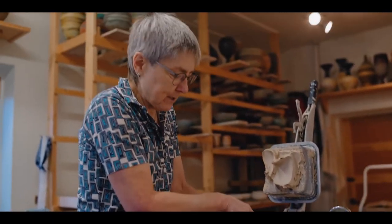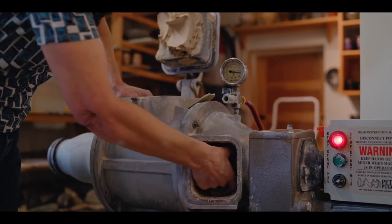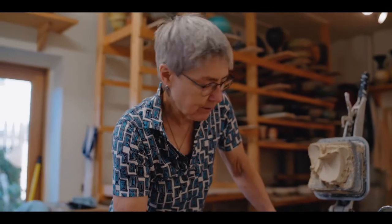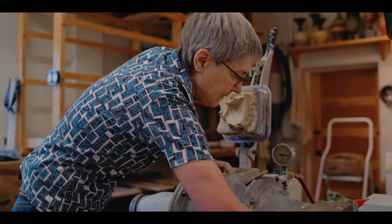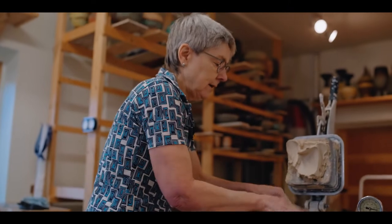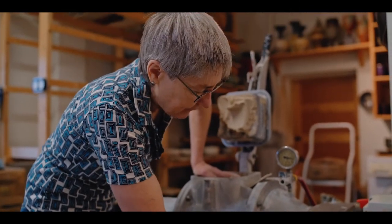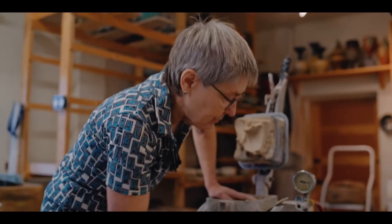If you overfill the mill a bit, the extra clay will come through into the back chamber. You want to check this frequently — you don't want it loaded up with clay. It's not unusual to end up with a small amount back here, so we just pull that out. That just shows you the mill was nice and full. The clay gets sucked back there by the vacuum — this is actually a safety mechanism, so the clay gets sucked into here and not into the bowels of the machine.